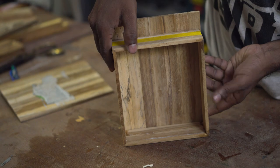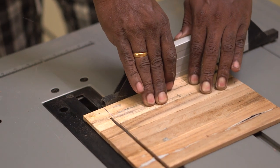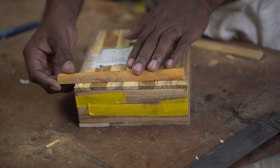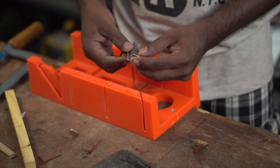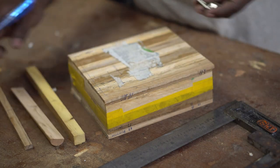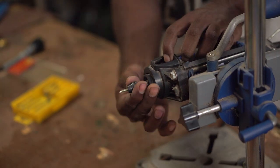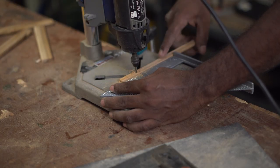Using this open box as a reference, the top and bottom pieces are cut to the right size. From here on, what follows is easy but very important. The place for the dowel is marked and cut to a length matching the tine holder from the package. I figured out it is called a Z-bracket, but let's call it a tine holder because it's easier to understand. The wood piece that goes underneath the top plate, which holds the tine holder, is cut to length as well.